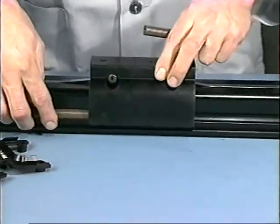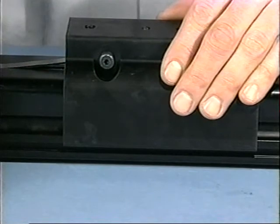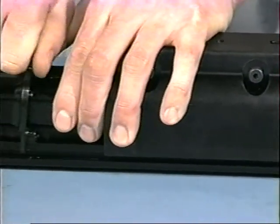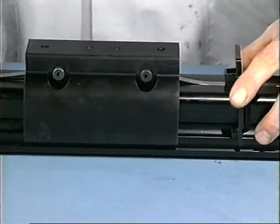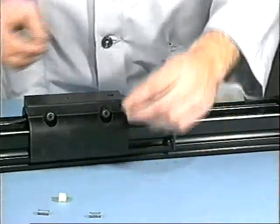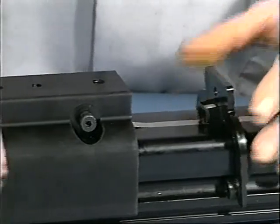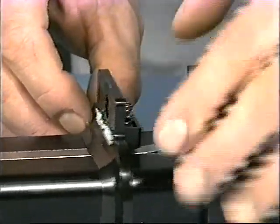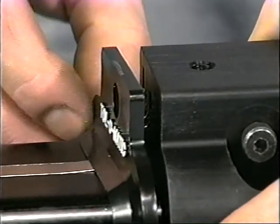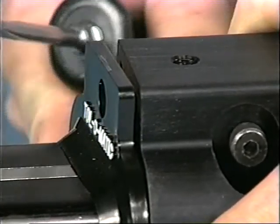Insert the bearing rods into position on the carrier. Push the end caps on the tube. Place band inserts into the pockets on the end caps, curved portion towards the carrier and spring hole facing up. Insert a spring into the hole of the band insert. With a flat-headed screwdriver or similar tool, compress the spring and slide the end caps up to the carrier.